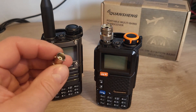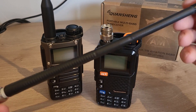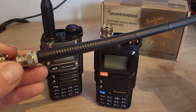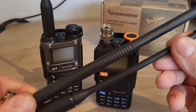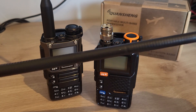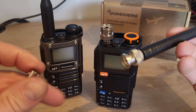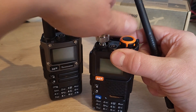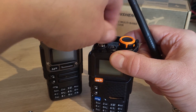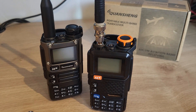Going back to CB or 10 meters HF on the amateur bands — I've been using an old CB antenna. It doesn't say the frequency on here, but I know this one is for 27 MHz. It's not much different in length to the stock antenna, perhaps a little bit longer, but this one is designed to work on HF. It would be useless on 2m and 70cm, but absolutely fine on the CB frequencies. We can simply attach one of these SMA to BNC adapters, and with the BNC connector on the top of the antenna, it'll sit quite nicely on the little Quansheng.